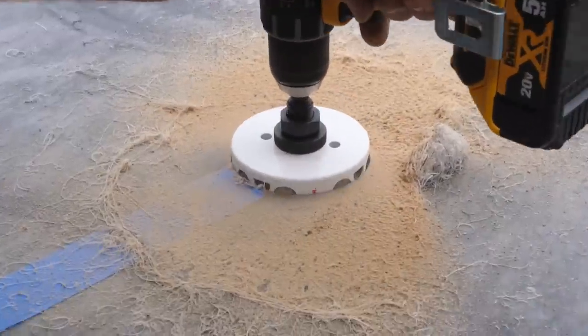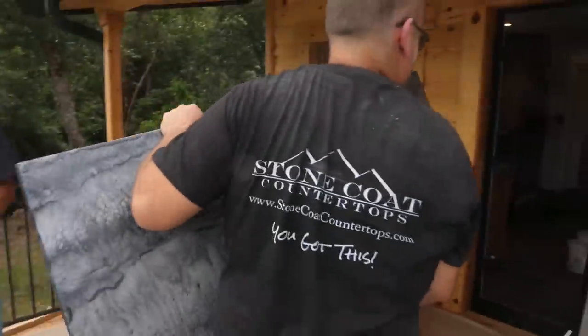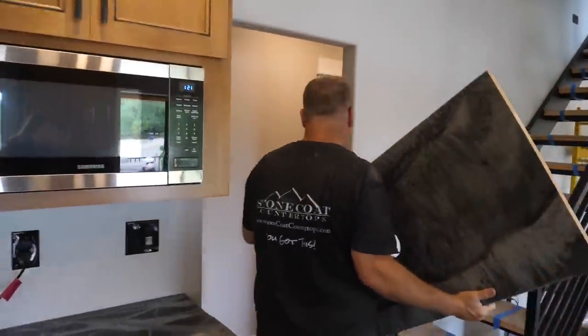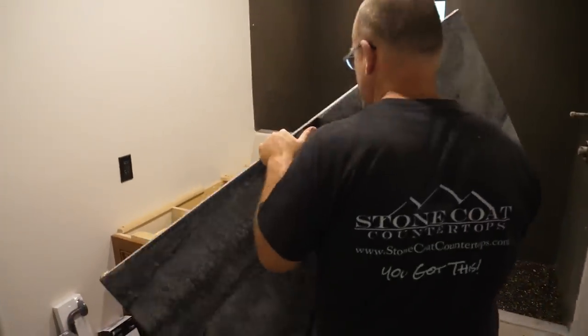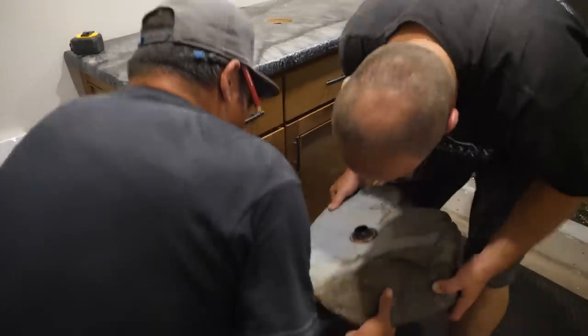If you have tight tolerances you may need to do a smaller access hole for that tail piece. When cutting and shaping on site, I'm simply using carbide-teeth fine-tooth blades and hole saws — the same thing you use for cutting wood, Corian, laminate, and similar substrates. Epoxy and wood are quite easy to cut and fit on site, and the wood tools you need are the same ones you'll find at the hardware store. It's not overcomplicated.